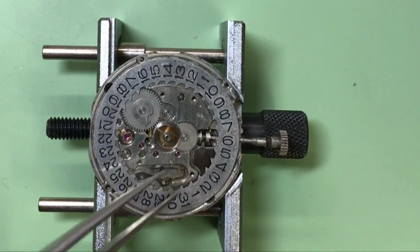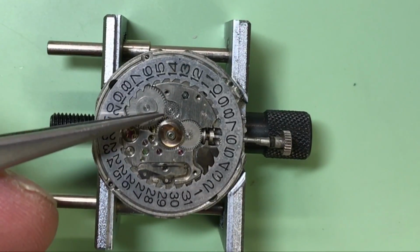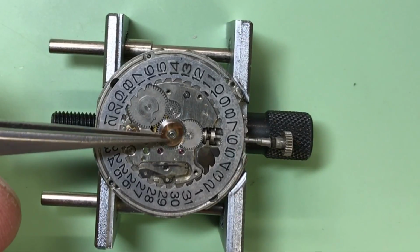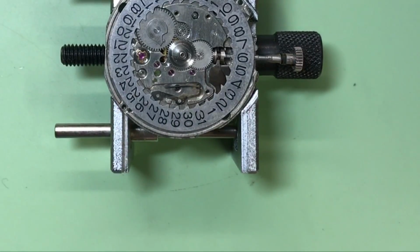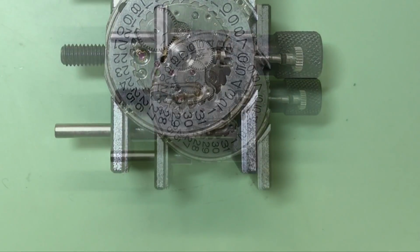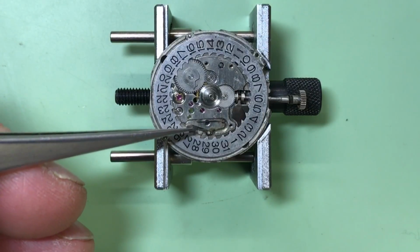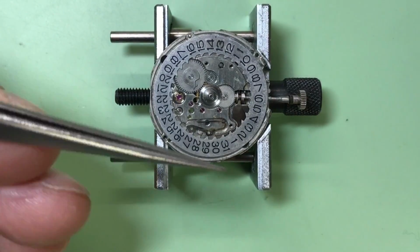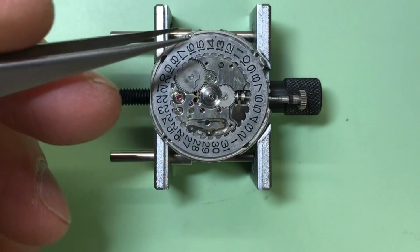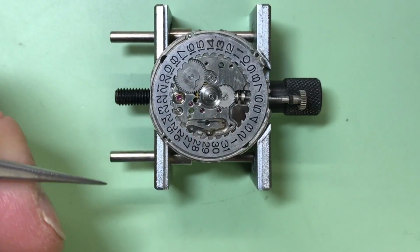and under the cover there is just a little dial foil there. So I will take that out of the way if I can get it. There we go. While we're at it, we'll put that back in the middle, and then we'll start with the rest of the other components. So the only spring you're going to find in this movement is this here, which is the date spring, I guess you can call it, and that's what keeps the date wheel. It's sort of like the click.